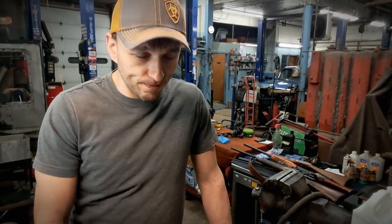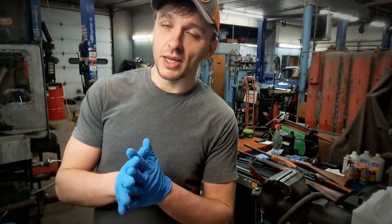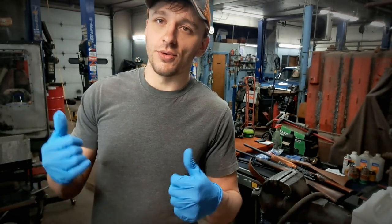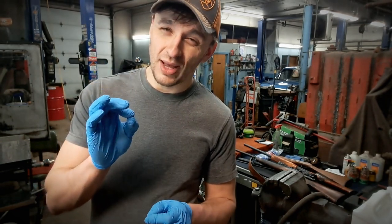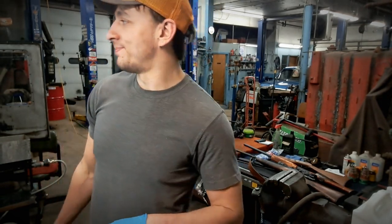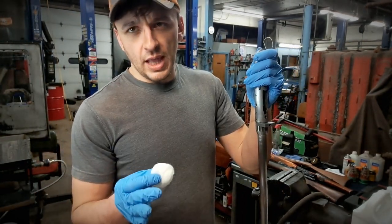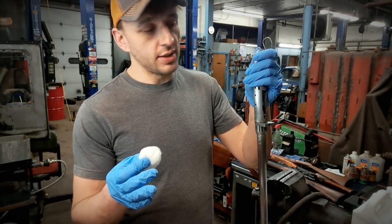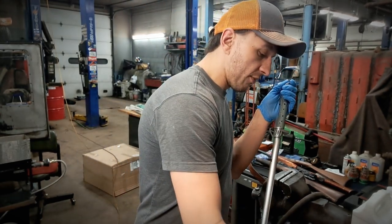One of the most crucial parts about this whole process: whenever you go to apply your bluing solution, you cannot overlap it. If you overlap it, it'll copper plate and you will be screwed — you've got to strip it and start over. So remember where you start and use as little overlapping as possible. Also, if you get any runs you're screwed too, so be really careful with how much you apply.